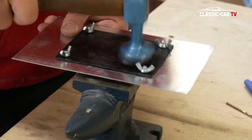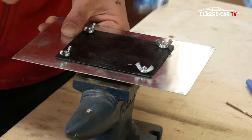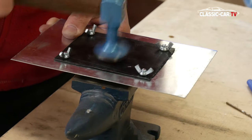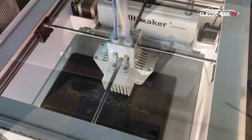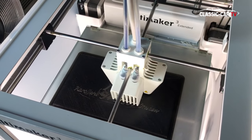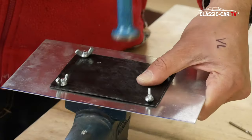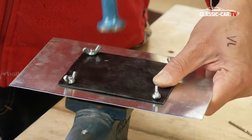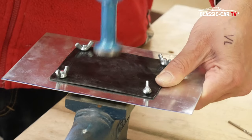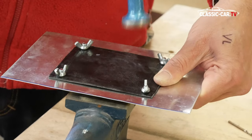With 3D printing, it's important that the load-bearing layer is not too thick, but remains flexible, otherwise the mould would break. We tried a few filaments and ended up with PLA. Only PLA has the necessary hardness to transfer the details to the sheet metal. We'll show the results later with other plastics like nylon and PETG.